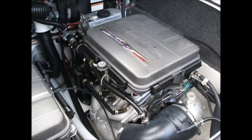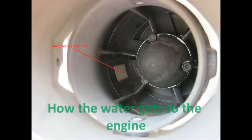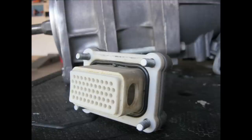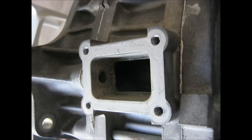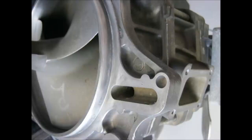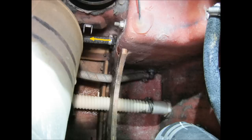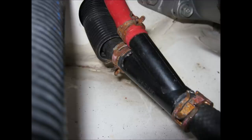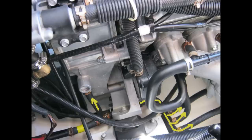During this video you will see yellow arrows which demonstrate my understanding of the direction of cooling water flow. Cooling water is fed to the engine by a pickup screen on the high pressure side of the impeller. You can view this screen by looking into the jet nozzle — you will see a white screen at the 9 o'clock position. Water flows through the screen and the passages on the jet pump into a hose, past the Y fitting, until it reaches 4 distribution points on the starboard side of the engine.